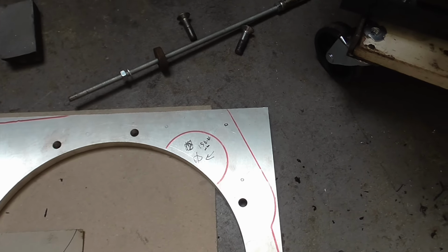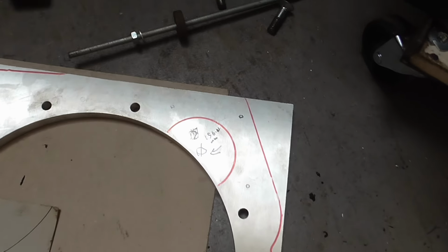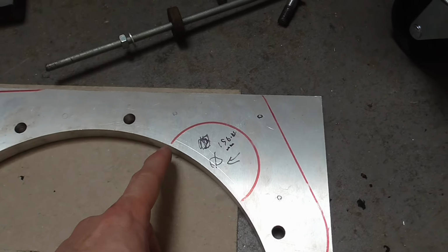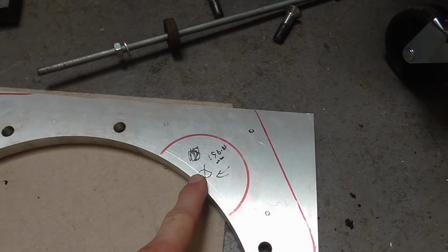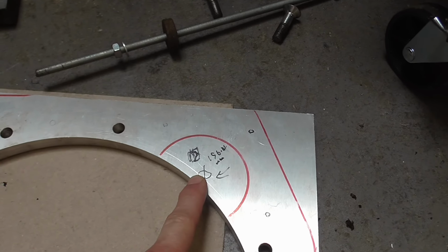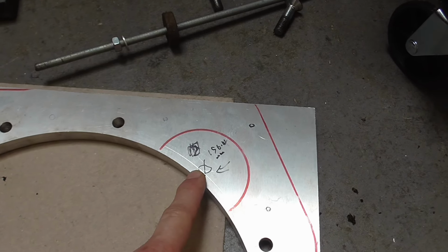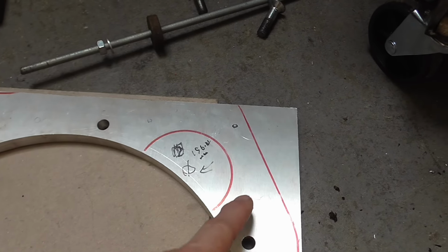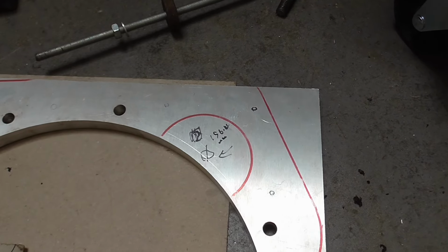Once I've chosen a centre line, I'll set this plate up on the mill and cut this clearance in with the boring head, and I can then do the final alignment to get the 3-hole pattern for bolting the starter on.